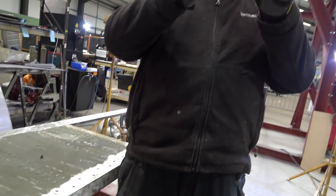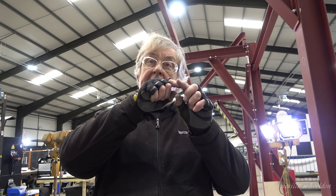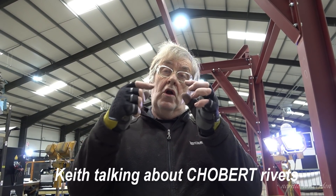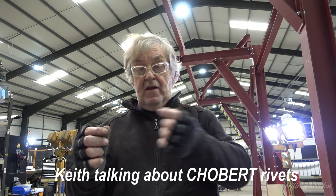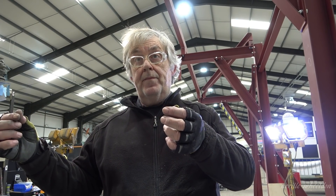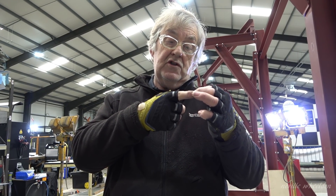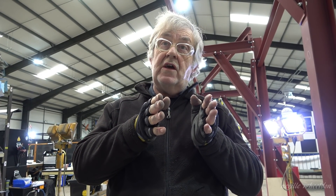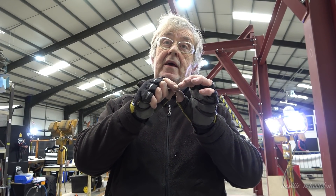You've got a steel mandrel and the end of the mandrel is shaped like a teardrop. You've got a hollow rivet and you feed them — they come in tubes — and you feed the steel mandrel through them and then load them into the gun. As you pull it, it pulls a set amount and just pulls through one rivet, and all it does is it just swells and puts through, and then afterwards you've got the option of putting a pin in it.